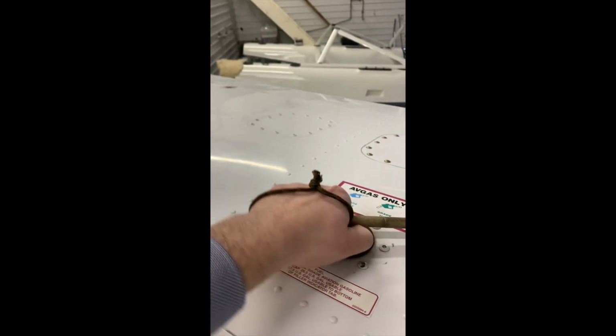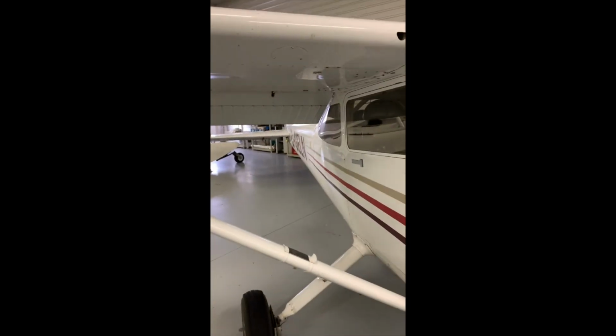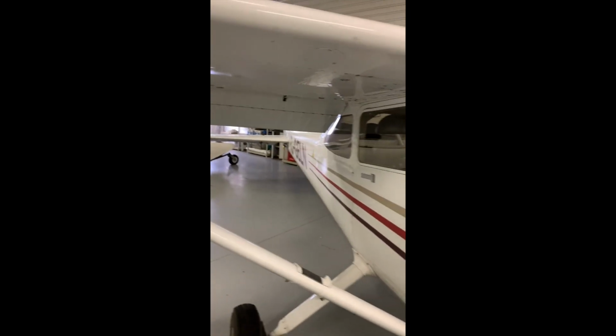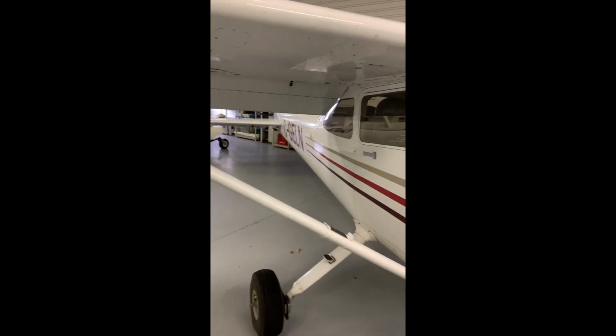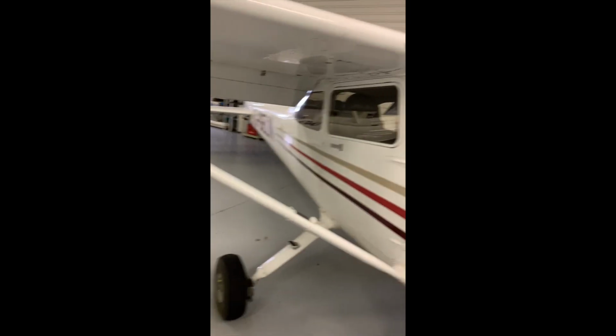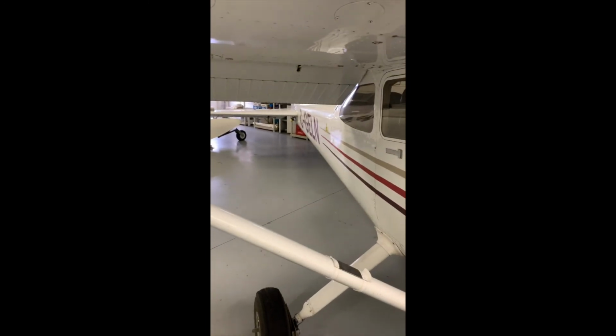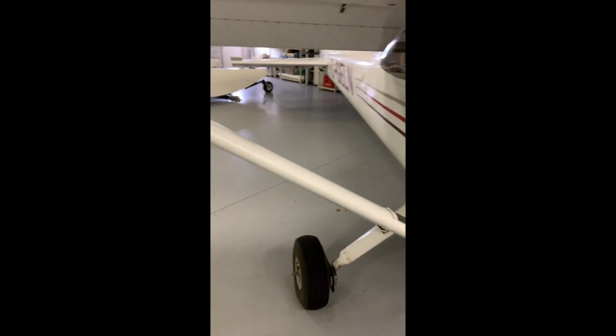I've dipped the other tank. It's indicating the same. And it's a really good habit to figure that out into an endurance. So we're 5/8. I'll be conservative and call it half. That's 26 gallons. If this engine's burning about 10 gallons an hour, I know conservatively I have 2.5 hours of fuel on board. So easy to do, something you should make consistent when you go flying.